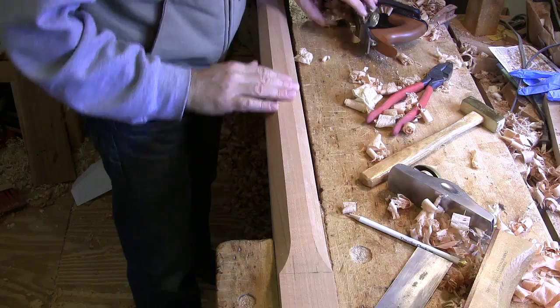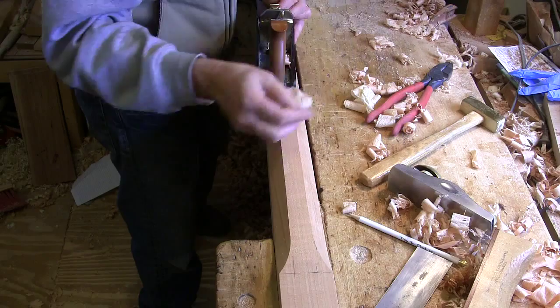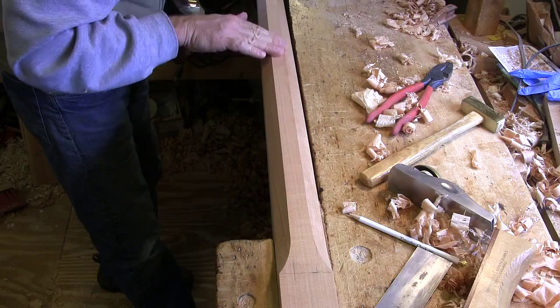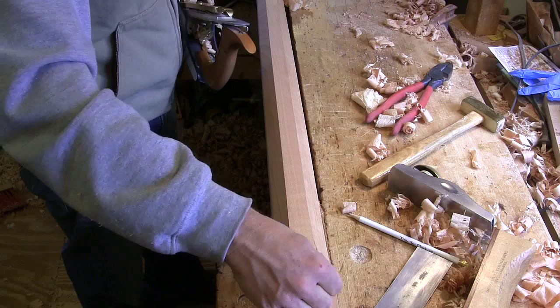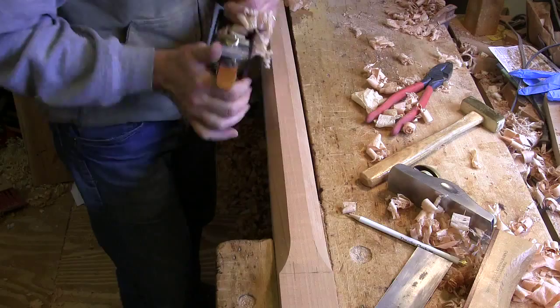So this section I'm just going to have to be real careful. This is where the headboard is going to join in. I'm pulling very fine tissue-like shavings. I've got all the marks out now, but I want to bring it down to my line here. This is one of the sawn tapers — the taper starts at this line where the lamb's tongue starts, but I usually saw it back an inch or so and then bring it down.